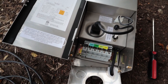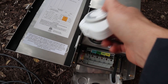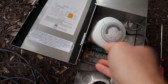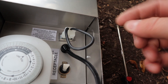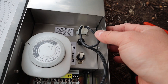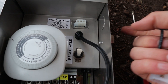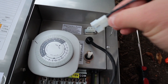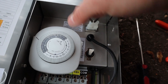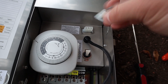To change it up you've got two options. You can either plug it in with a timer or a smart plug — you plug that in here and then plug this piece into it. Or right here, you pop this out and you can put a photo cell. A photo cell makes it so the transformer is always on when it's dark. You plug the photo cell in right here. Don't throw this plug away, because if you ever don't want a photo cell, you have to have something plugged into this port always — otherwise the transformer will not work.